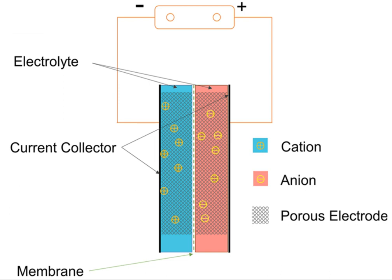Electrochemical capacitors (supercapacitors) consist of two electrodes separated by an ion-permeable membrane separator, and an electrolyte ionically connecting both electrodes. When the electrodes are polarized by an applied voltage, ions in the electrolyte form electric double layers of opposite polarity to the electrode's polarity. For example, positively polarized electrodes will have a layer of negative ions at the electrode-electrolyte interface along with a charge-balancing layer of positive ions adsorbing onto the negative layer. The opposite is true for the negatively polarized electrode. Additionally, depending on electrode material and surface shape, some ions may permeate the double layer, becoming specifically adsorbed ions and contributing with pseudocapacitance to the total capacitance of the supercapacitor.